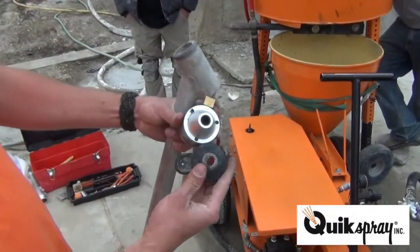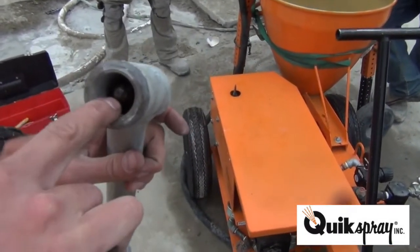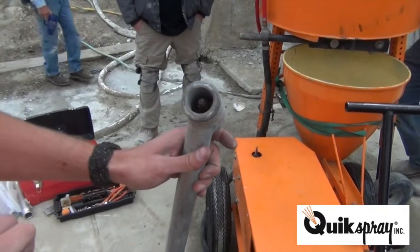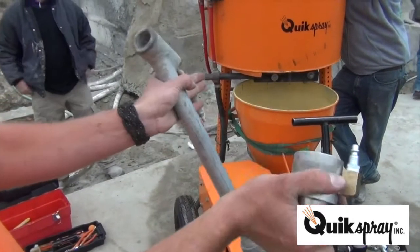And then inside this gun, we have what we call a plunger, airstream plunger. And right here, this little hole, these can be interchanged between about 4 or 5 different sizes to give you different air atomization. Put this gas fitting on up there. This plunger goes in and out to develop your spray pattern. Our problem is we need 2 PSI.